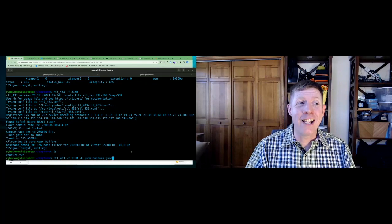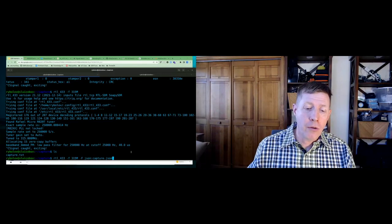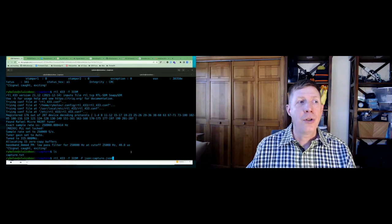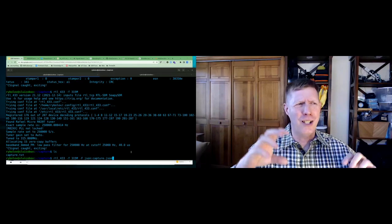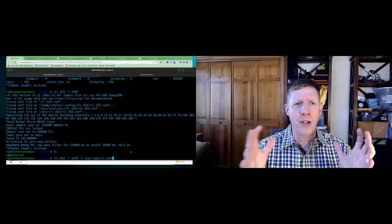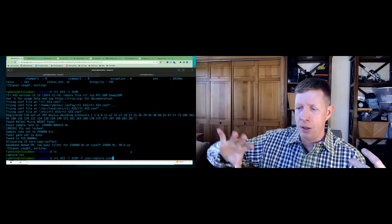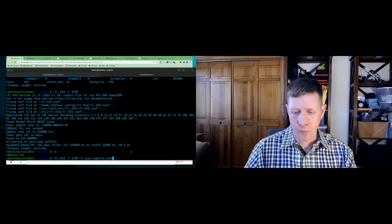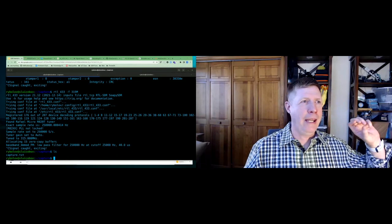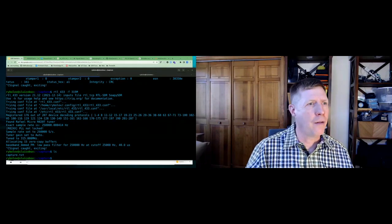One more thing that it does that's fantastically awesome is that you can take RTL-433 and send everything that it finds to an MQTT server. MQTT server is used for all the home automation stuff. You have your light switches, the temperature, a bunch of sensors sent into MQTT. Well, you can also capture RTL-433, put stuff into your home automation system, and then perform actions based on what these sensors are telling you. It's a really good way to grab the outside temperature and perform actions on that. You can do a whole bunch of different things using RTL-433, okay?